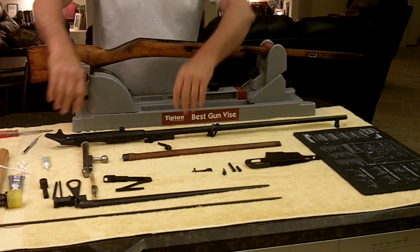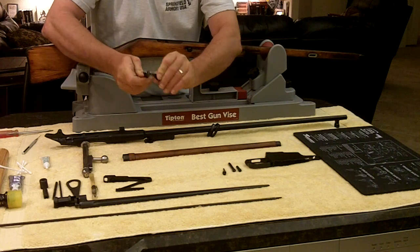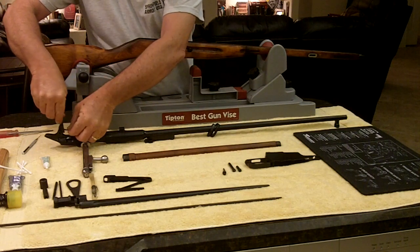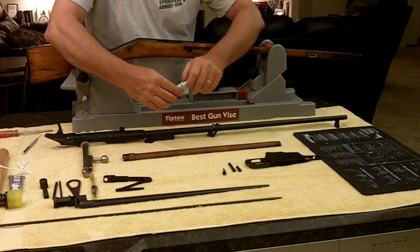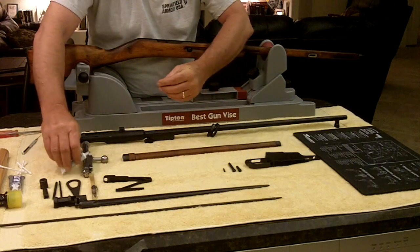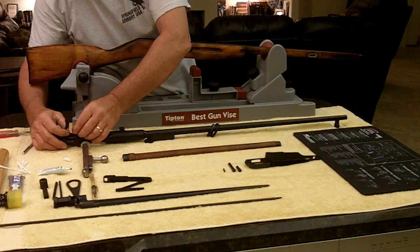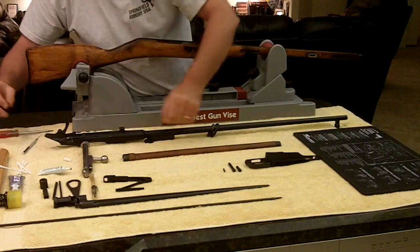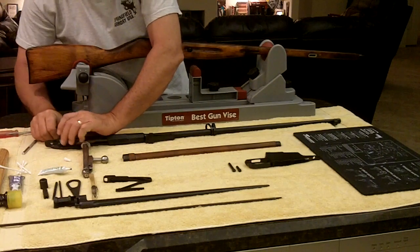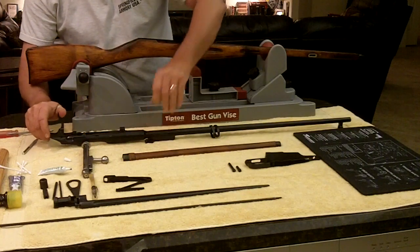I had a raccoon on the porch. Anyway, the first thing we're going to put back in is the trigger and the sear. You'll simply fit the sear into the trigger. It goes down in here. I'll get the screw started. I've got a little Gun Tight here — it's made by Loctite, specifically for firearms. Just put a little bit of glue onto the screw, just to keep it from vibrating out. But it's not a ridiculous strength — if you need to get it back out again, it's not going to be an issue. We will be taking this back out probably to make adjustments. So I'm just going to hand tighten it for now, then get a pen, kind of flip it on its side, line the hole up with a pen, and it'll push right in. Just like that — it's back in. Feels pretty good. It feels better like this than it did.